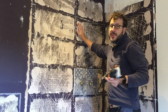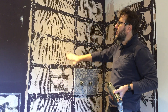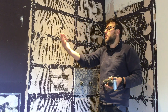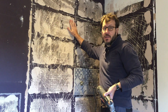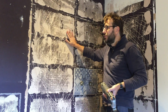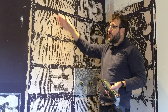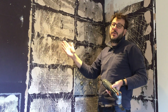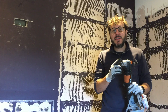What we're going to be doing today with this multi-tool is removing this wall. We want to create a recess that will push our shower back into the room next door and build that wall out so we've got a nice walk-in shower. This is standard plasterboard, about two centimeters thick, pretty easy to cut through. Our shower tray is going to be 1.8 meters — there's a joist on the wall at exactly 1.8 meters, which is the neatest place to work to.